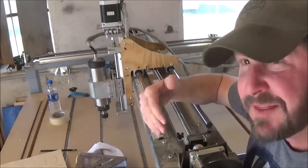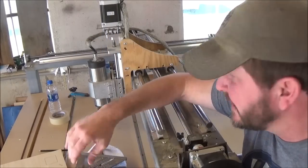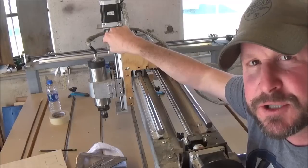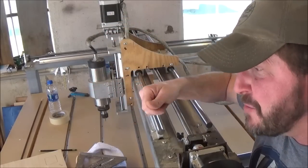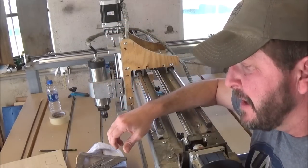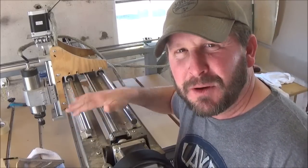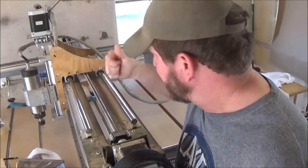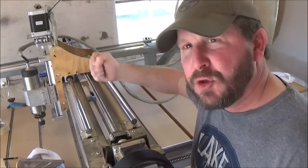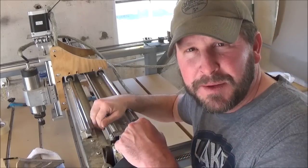The way you check that against your gantry is run your gantry up to the edge of one of those lines. If you're not lined up on the far side on that line, you know you're kind of torqued, you're a little bit off, and you might actually have to adjust that occasionally. Don't try to overthink this too much. These are simply parts. If you just look at them that way, you have built a box and you're just putting parts that you order on top of it and making sure they're square and perpendicular.